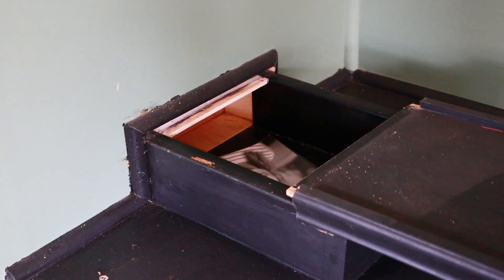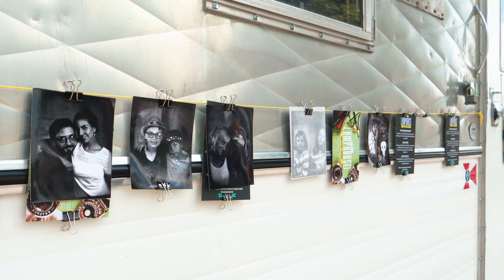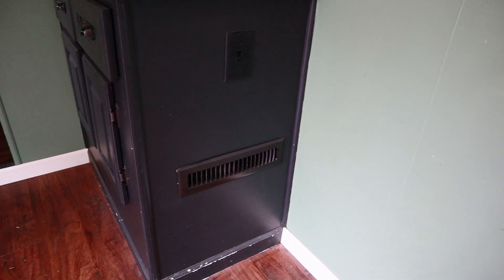Once the print was done, we passed it through the wall on the other side and handed it off to the people. One thing with a little dark room like this is ventilation. The way you really want to ventilate a dark room is positive pressure — you force air in, which forces the bad air out. We put a little fan motor and vent in the cabinet on that side of the dark room to draw fresh, air-conditioned air from the front part into here, keeping it fresh and cooler. It didn't work really well, but it worked okay.